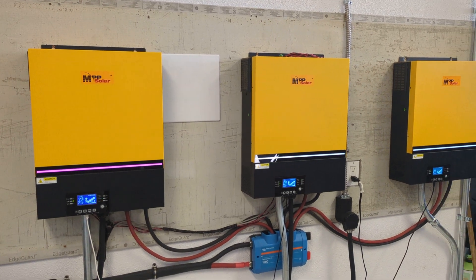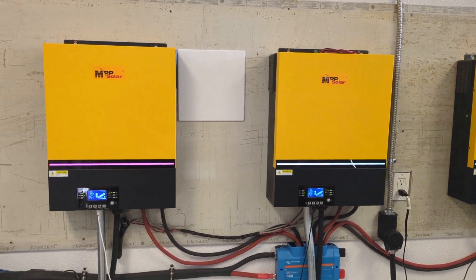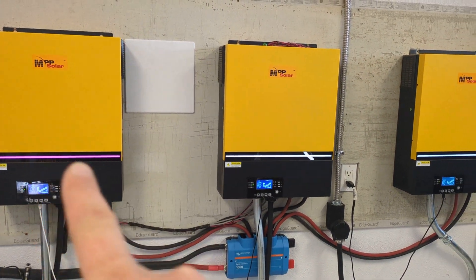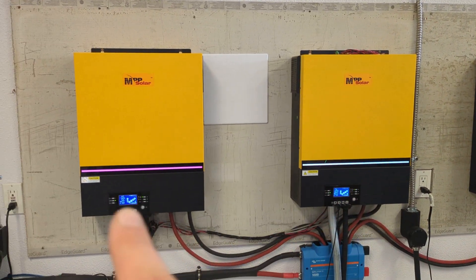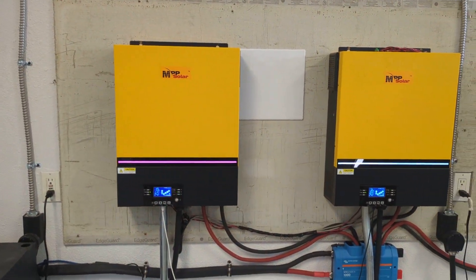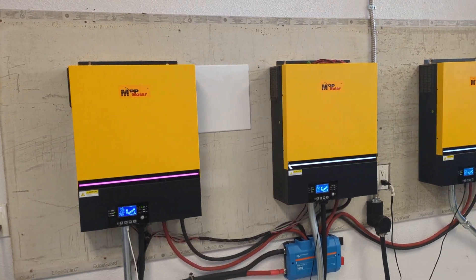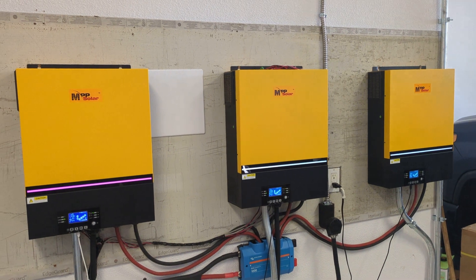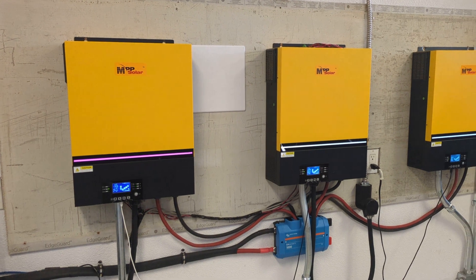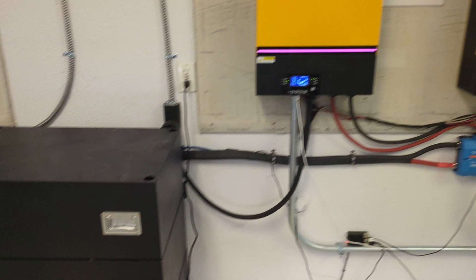I have the auto transformers and I decided to not do that because I want a system that is on battery all the time. I would have had to take three of these inverters and connect them to the power feed side, and then use the other three inverters as battery chargers. What this ends up working out to is a system that is always on battery power — essentially a gigantic UPS.